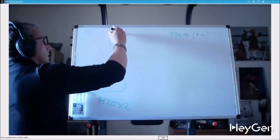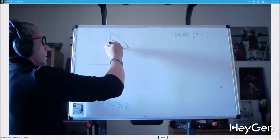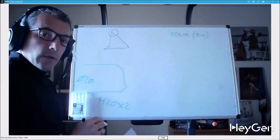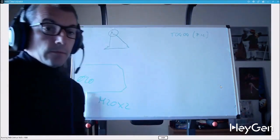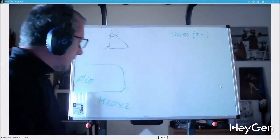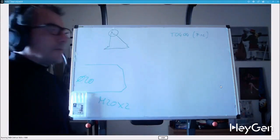Be careful, the threading inserts are not all the same. Each threading insert is generally made like this, and this is the part that does the work. Each pitch, not diameter, will have a different shape for this tip. So if you go to order the inserts, tell your tool supplier what pitch you are going to use, or correctly interpret the data from the purchase catalog.